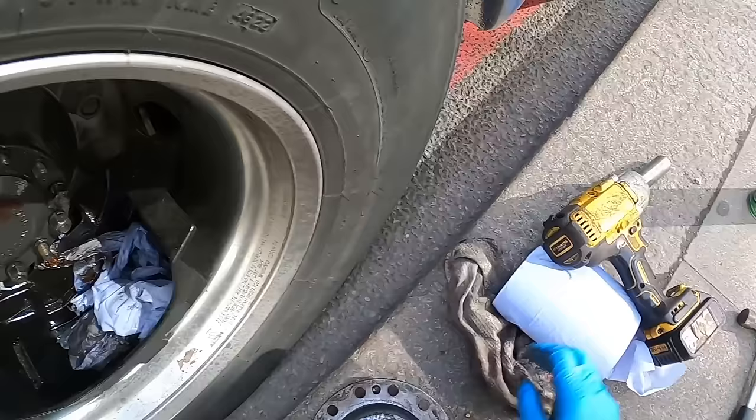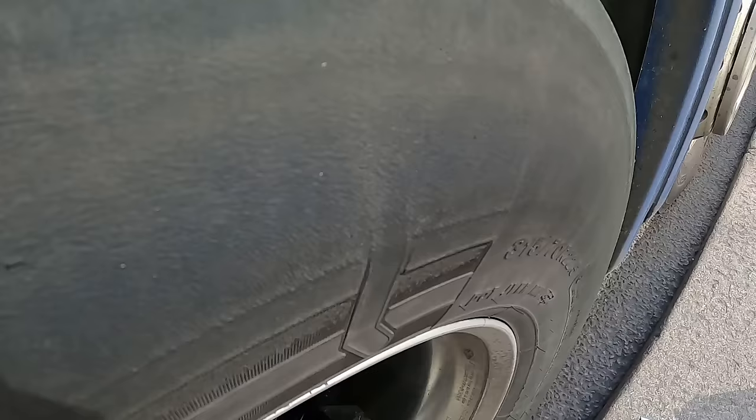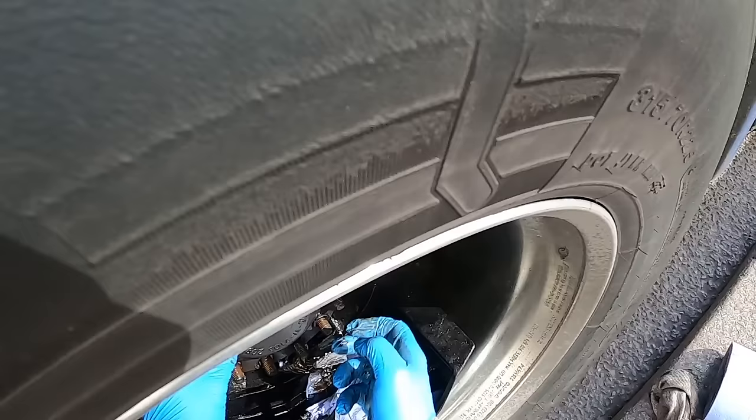Yeah, only one half shaft removed on these. Just as well, so I don't have a job getting the other shaft out on that. Quite a narrow road, I'll probably have to take one shaft out. If it was a 400 double-decker ZF axle, we'd probably have to take one out, then pull up the road a little bit where it's a bit wider so I can get the other shaft out, but only one half shaft on this. Oops, oh, look at that, right in the hole.